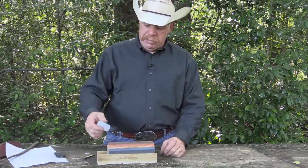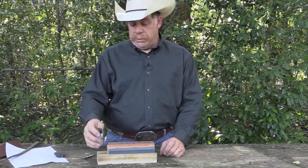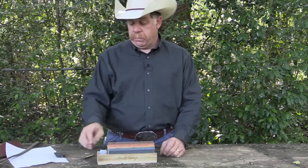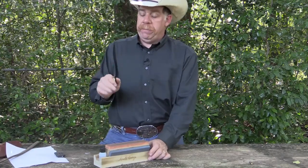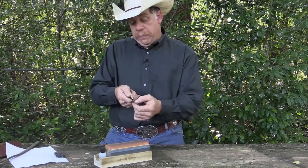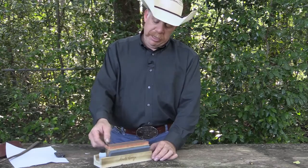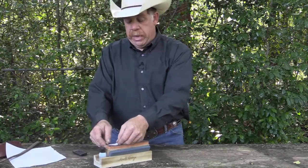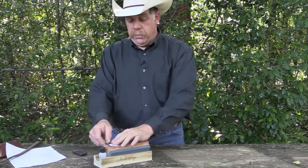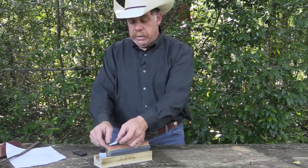What you're going to do is very simple. Put a couple drops of honing oil on here. There are different types of stones, and not every stone is going to give you the same performance. You notice how the oil has penetrated into those pores. What I like to do — now this is just what I do — I look at my knife and figure out the grind line. That may be like a 20-degree grind line. I lay my knife flat on the stone and lift it up just until that grind line meets — there's no daylight under there. You can take a piece of paper and slide it under; when you tip it up just a little, you can't pull it out. That's your angle.